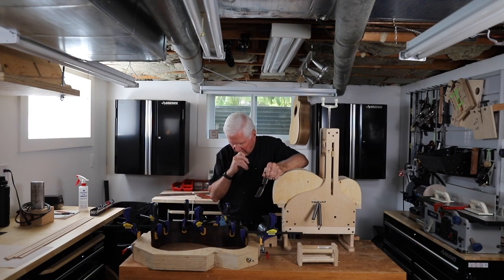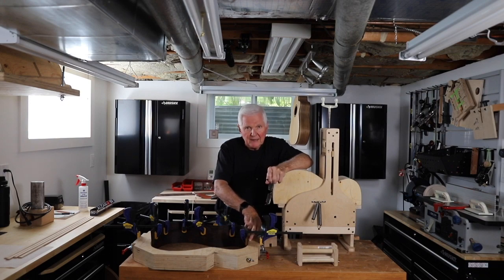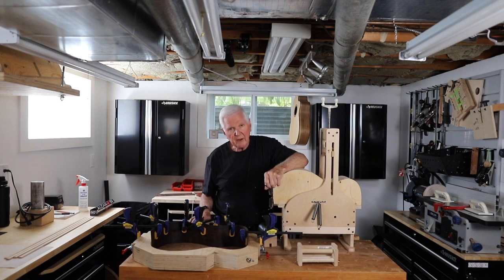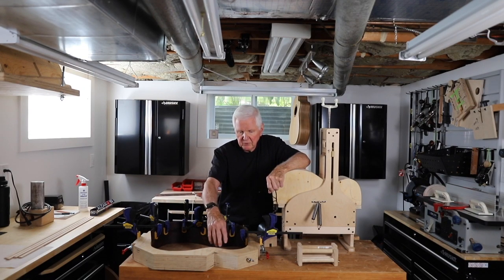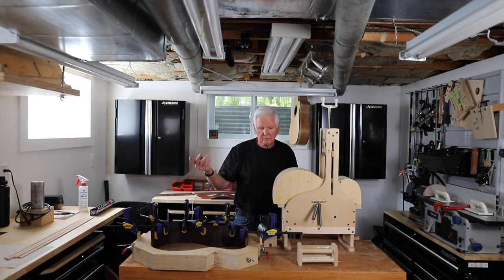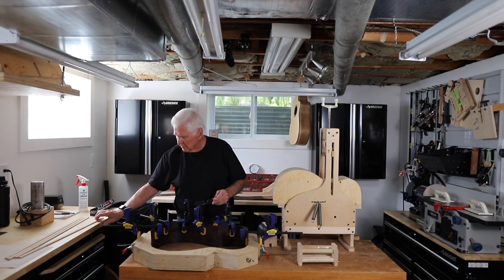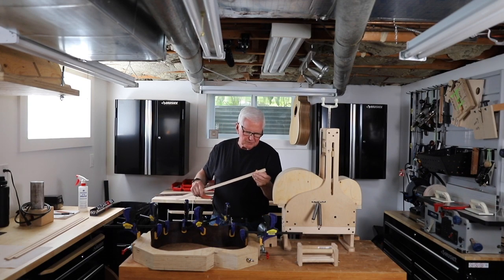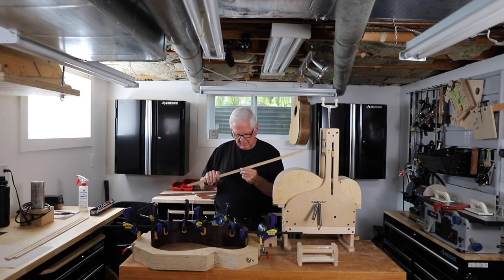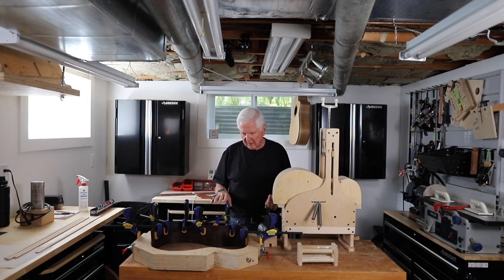The easy thing for us to do on the next side is when we take this apart where the split is, I can just mark a line. Because we know we've got the one side true, I'll use my square to draw it across, and we'll just cut that on the bandsaw — I'll show you how I do that as well. Then we'll do the same thing for the other side and it's all good. Then it's a case of doing some gluing. I need to think about whether we're going to do the kerfing on these pieces here — they bend in the same shape and run around here. I really think I need to put some kerfing marks through those, but I might try thinning it down first just a bit to see if that would do the job. Whatever it is, it's going to be done and it's going to be done right.